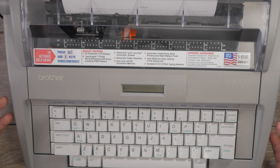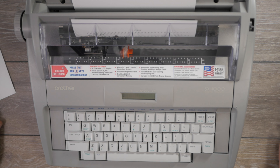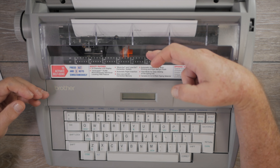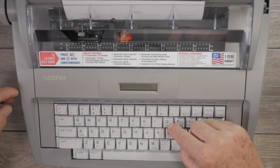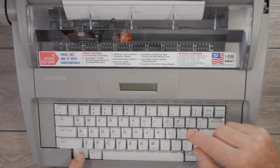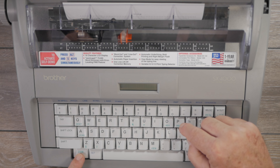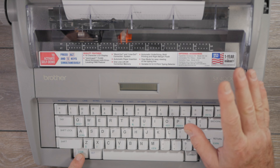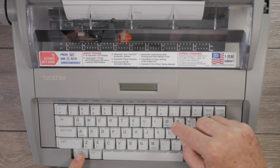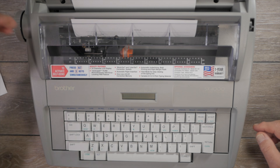Line-by-line mode gives the best opportunity for error-free copy. If you want to move the print position back up to a previous line, use the green reversing feature by holding the green Code key — every press is a half line, so two presses of Reverse goes up one full print line, and two presses of Index goes down one full print line. This is in increments of a half line. Use this rather than the platen knob, which is continuous motion — moving paper with the platen knob will lose your accurate line spacing.